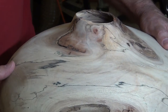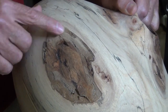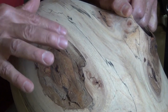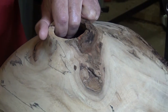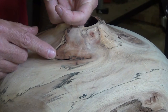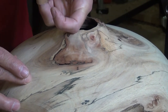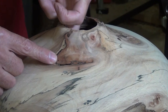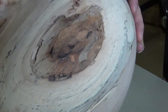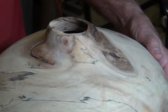In filling voids, there are basically three techniques I use. The first I call pressure — just fill the voids with bark or material, let it sit, and put CA glue on it. The second is for a void that goes all the way through — you can't fill it without the material falling through, so you put tape on the back side to keep material in, then add the fill and CA glue. The third method uses cord, and we'll get to that in a second.